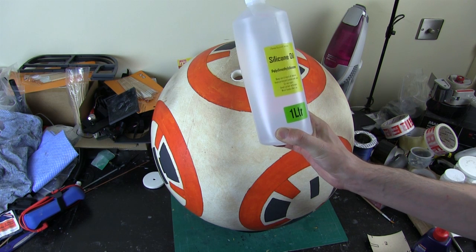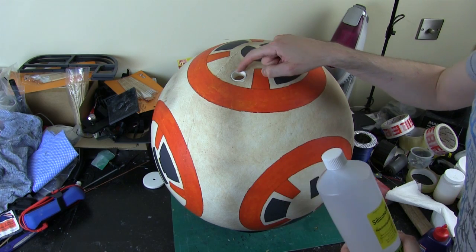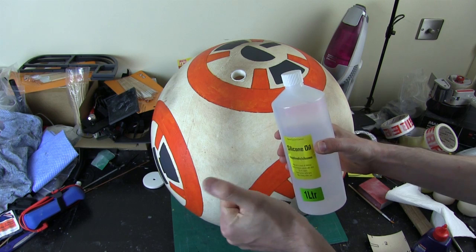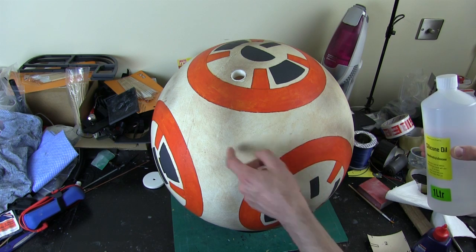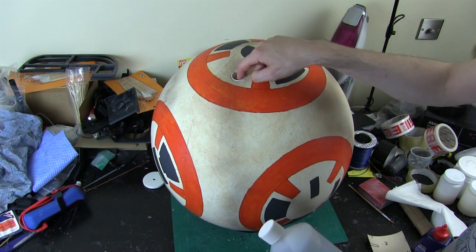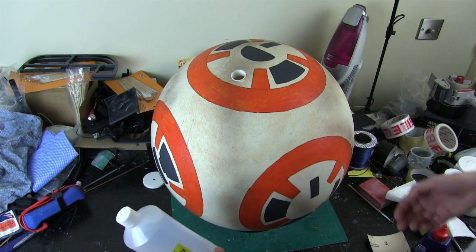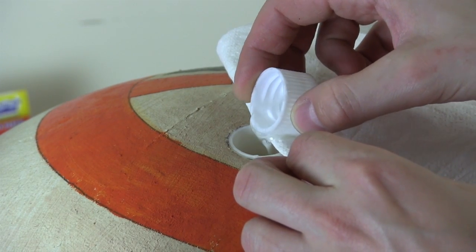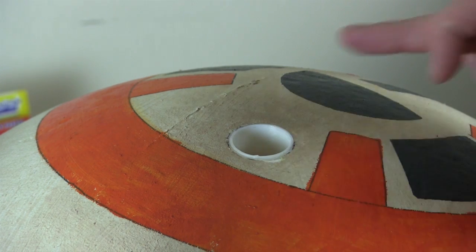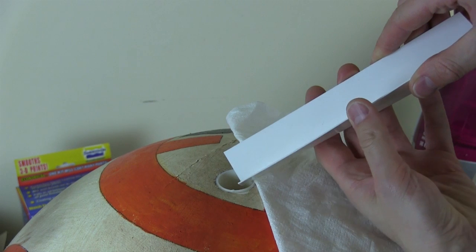However, silicone oil is quite funny stuff — it's going to make a mess if I spill it, and it's also going to be extremely hard to clean up. So I'm going to have to be extremely careful to get it through that hole without coating the hole, because then it will be very hard to seal the hole with anything ever. There's already some residue on the outside of the bottle, and I only need the tiniest amount to take the noise away. Of course it will eventually coat the ball, so there will be less on the ball bearings, and I don't know what the results are going to be. I can't risk the ball rotating and this spilling out and coating the hole because I'll never be able to seal it. So I have to basically guess how much to put in, seal the ball, and then do the rest in software — hopefully tuning up the PID loop to make it balance still. I've just put a small quantity in the cap. Let's try this.